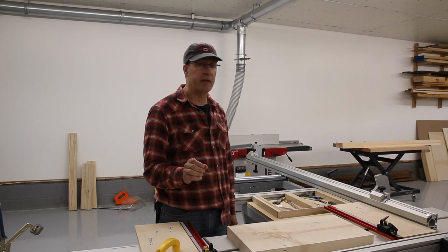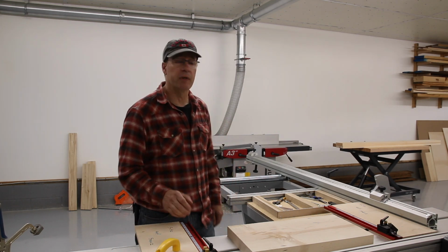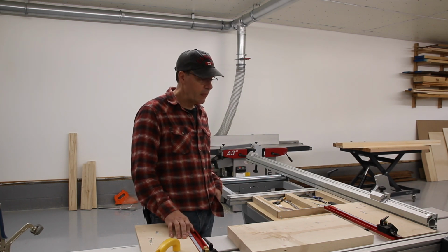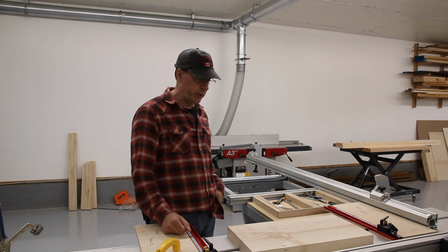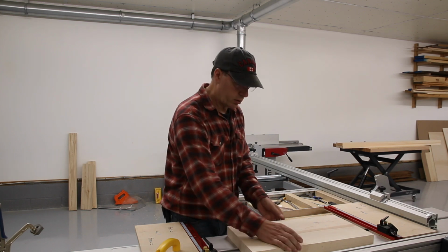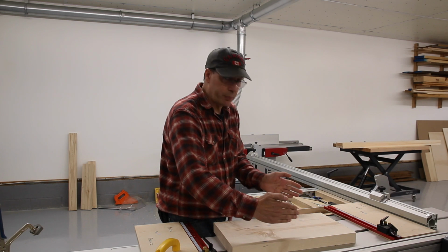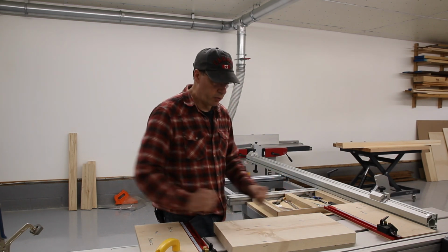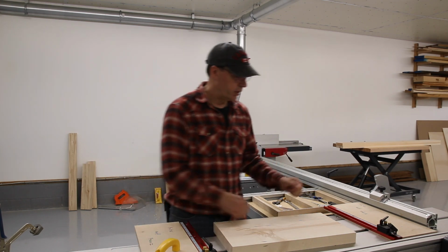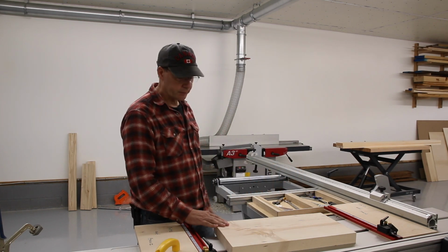And I also have a very thin blade. The teeth on it are not carbide, they're diamond, and I did pay $700 for that blade, and it really cuts well. I already know from experience that I get the same problem too. If I cut a board like that in half, you've got a lot of material on each side, and if there's stress, it will pinch on the riving knife, and it's almost impossible to push through sometimes. Sometimes I even have to back up and recut the groove because it closes itself on the riving knife.